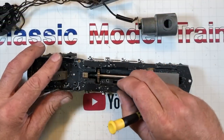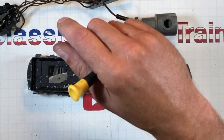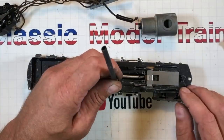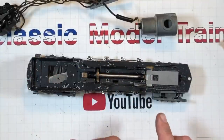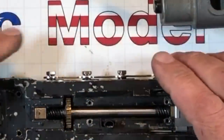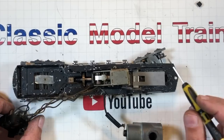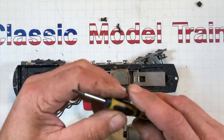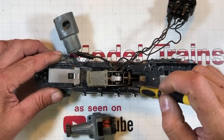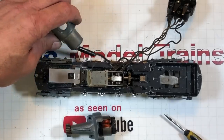This little plastic insulator goes down over this brass — I think it shrunk on me, I think we need a fresh piece. Heat shrink. This will shrink up when we solder that back on, and it's going to do its little job of keeping everybody insulated. So now we can start to reassemble this whole concoction. E-unit fits in like this, four bolts — two here, two over here. These four screws are in. You've got to come in at an angle because this is in the way. Hassle.